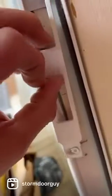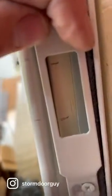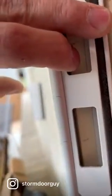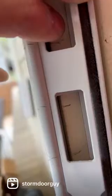you can make sure that those lines match perfectly so that you know they're going to hit where they should. If your door's not latching, it's because the strike plate is too high or too low. If you see something like that, it means the deadbolt is hitting the top of the strike plate and not actually going in the hole.